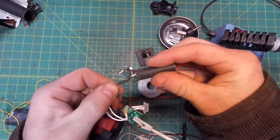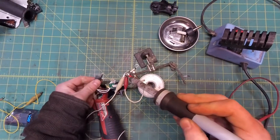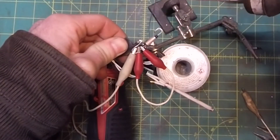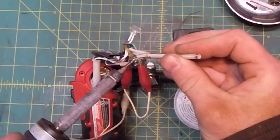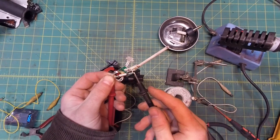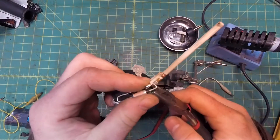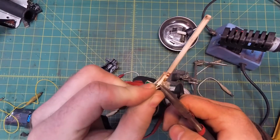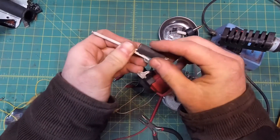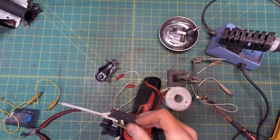Take the longest piece of heat shrink tubing you can fit and slide it over the end — I found eight millimeter worked pretty well. If you'll notice, I've got my alligator lead heat sinks in place. Get the solder on the crimp fully melted and then done. Same thing on the other end. And just one more good luck continuity check before we put the heat shrink tubing on. I'm gonna compress these bends as much as possible just to make it fit nicely. Then shrink the heat shrink tubing with your heat gun on the lowest possible setting.